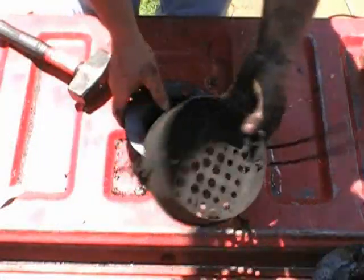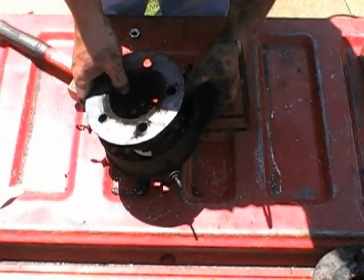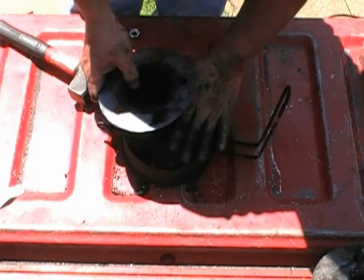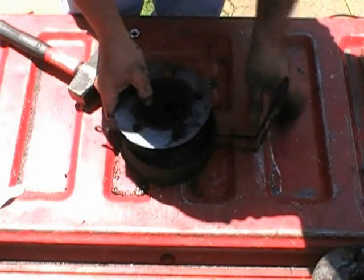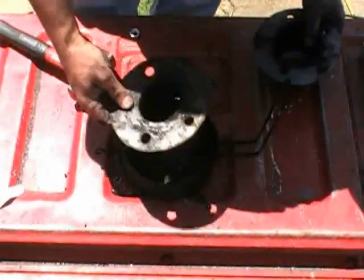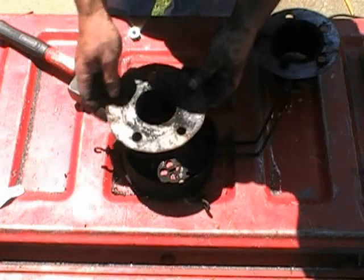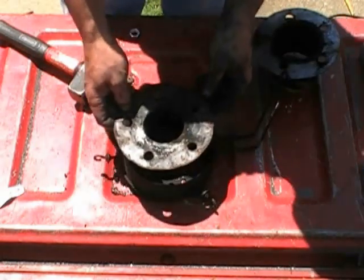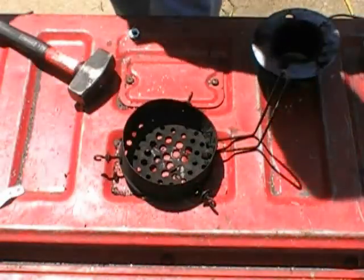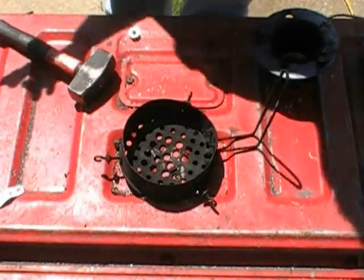Alright, this is my ash grate here, and normally I'm set at maybe about an inch above it or something, give or take a little bit. And this thing will actually, as it's emptying down, all the biochar will fill up and hang on the sides of this thing, and as you shake it, it falls over and makes room for more of it, okay? But when I was using this inverted bell, for some reason, too much material was falling through the bottom of it, and I wasn't holding a good ember bed. Now, I could have ran it much closer and stopped that, but I like the design that I'm working with now. To me, it's more stable. The videos that I'm doing are a proof of it, the gas that I'm getting out of it, and you guys have actually seen the flares that I'm getting off of it.